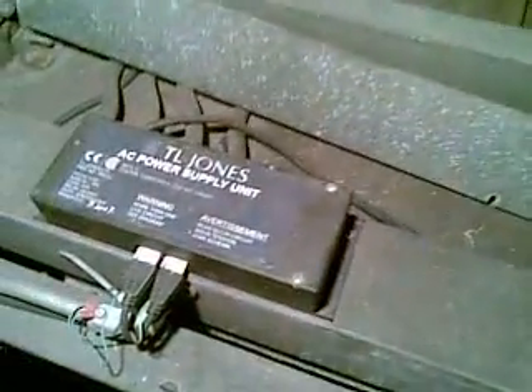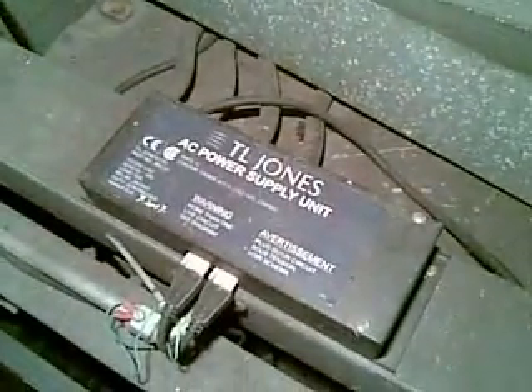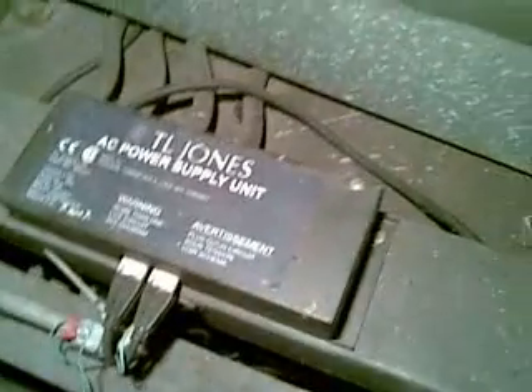There's a top of car fan, and over here we've got a door scanner unit — it's a TL Jones, which is made in New Zealand. Basically you've got the receiver and the transmitter over here on the doors. The flexors come up and just plug into the box, so that anybody walking through the door while it's closing will have it reopening, and there is no impact placed upon persons trying to enter or exit the lift car.